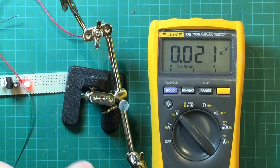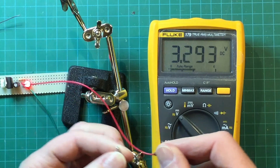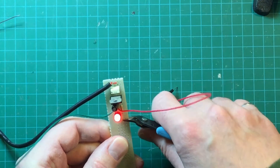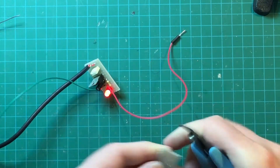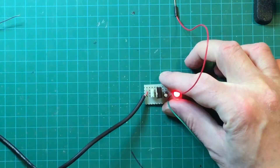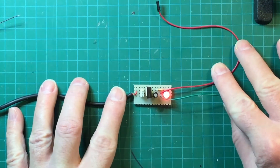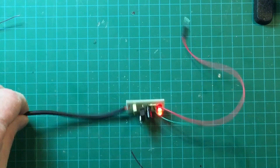Here's the vector board almost complete. We'll hook it up to the multimeter and check that it's working — and there you go, we're getting around 3.3 volts, so everything is as it should be. We'll just trim the circuit board and it's project complete. This was a very quick and cheap build: the cell phone charger was free, a scrap of vector board is free, it's a dollar or two for the voltage regulator, and just pennies for the other parts. I'm really happy with this build and the cost.